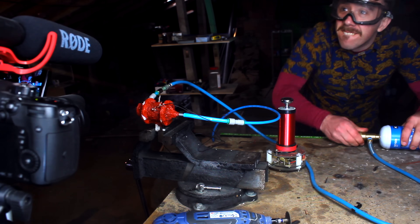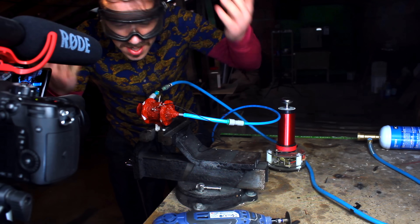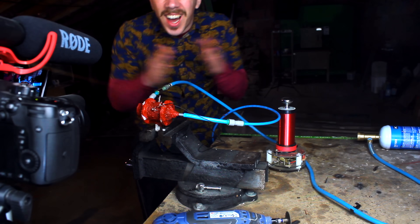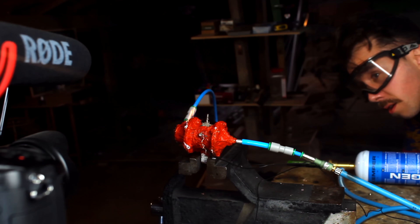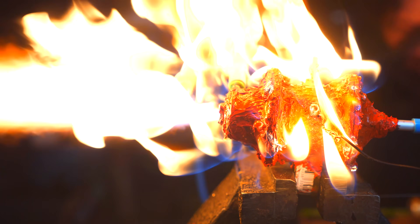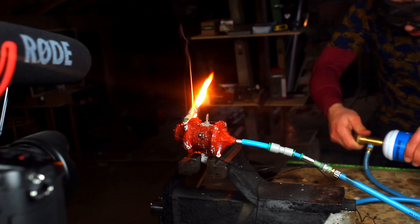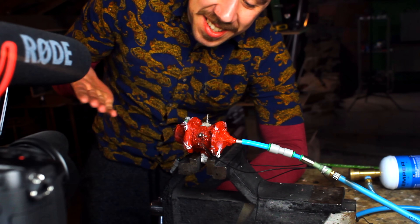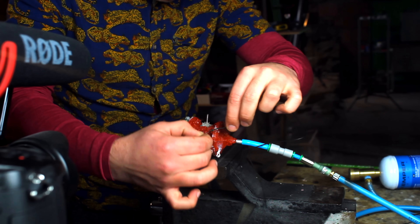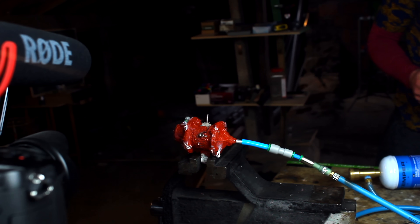That's amazing — it's not burning! The ceramic is not burning! It's smoking a little bit, but it's not burning. The vortex cooling is working. However, every time I increase the chamber pressure, it starts leaking everywhere. If it wasn't leaking, it would work properly. I need to find a way to stop the leaking.